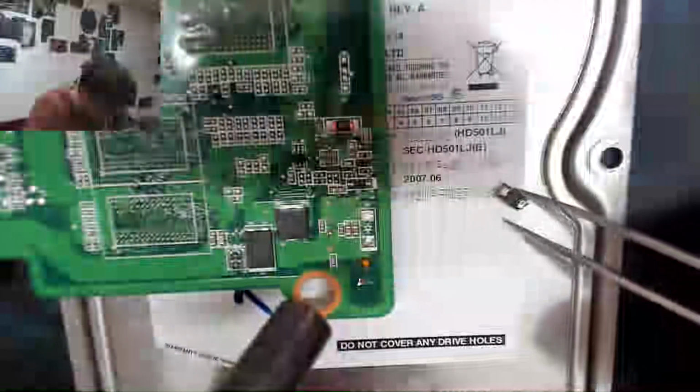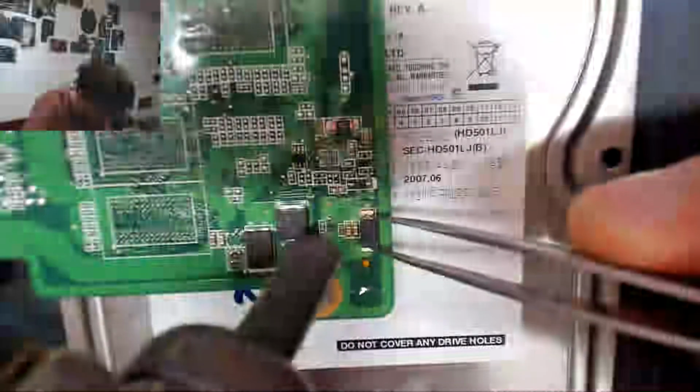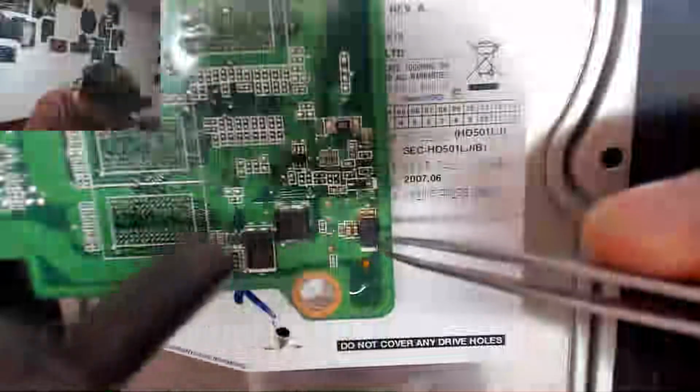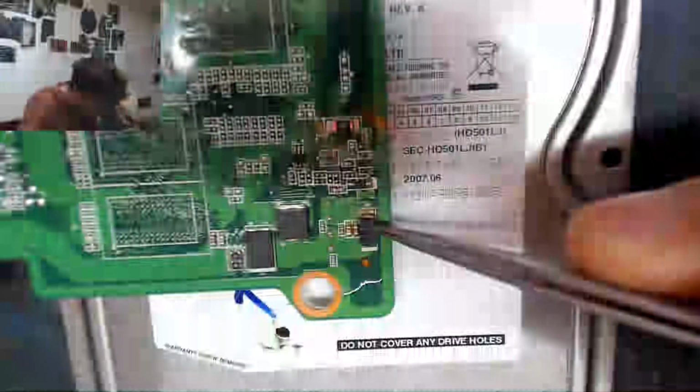I'm going to turn down my airflow. If you're blowing the component away, turn down your airflow. That's what the airflow dial is there for. Damn it. I've turned down my airflow, now I just need to get good and not blow away the component. I've already blown away all the flux. Oh no, that's actually going to need soldering. I'm not going to get away with being lazy, I don't think. We'll touch that up with the iron, just for good measure. Did that even stick? It did.